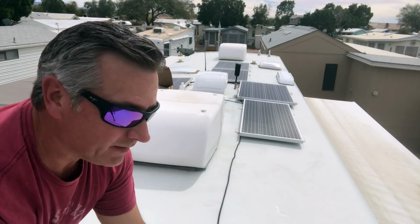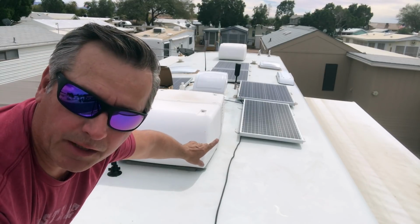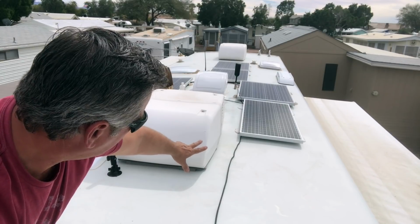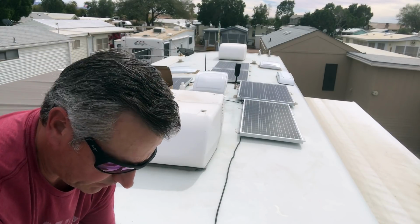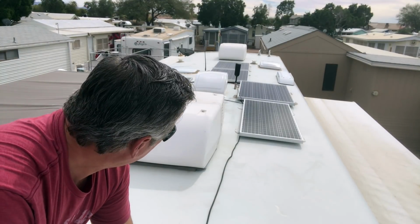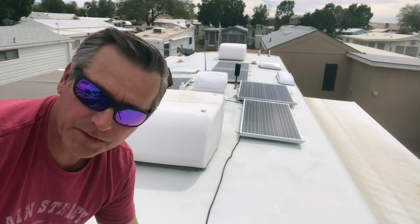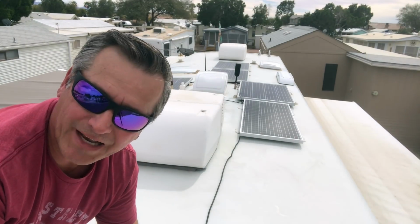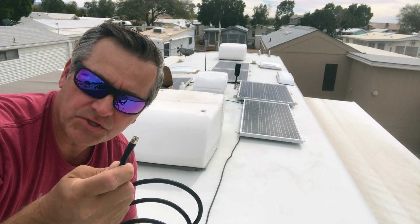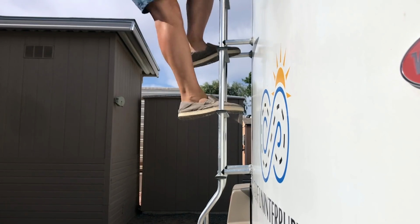That's the basic run for the exterior cable. I'll come along then and put in some of those anchors with zip ties, probably every 10 or 12 inches, something like that, all the way to this front entry hole here. Drop this down into the front cap, go inside, get all the equipment removed so that I can connect this end of the cable up to our machine-to-machine booster. So let's go inside and knock that out.